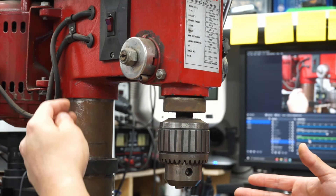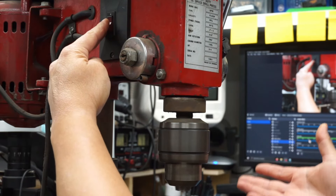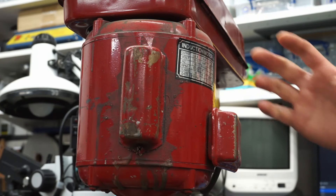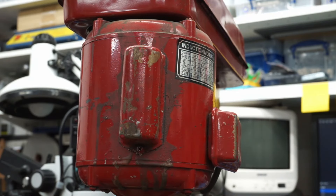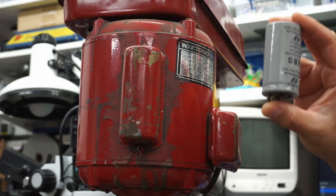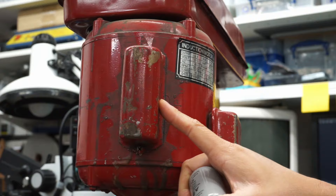If I try to get it going again after I've just recently turned it on, sometimes it will spin back up. It just takes a little bit of effort for it to start spinning. So what could be the issue? Well, if you flip it over to the backside where the motor is located, I believe our problem is going to be hiding underneath this bulge right here. And what we're going to see underneath there is a capacitor. So I think this motor has a bad capacitor.